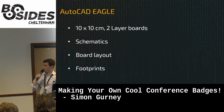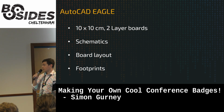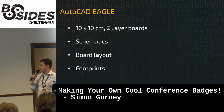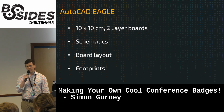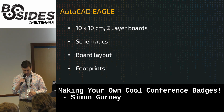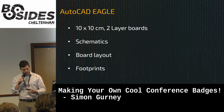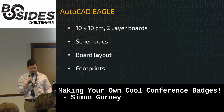So AutoCAD Eagle is absolutely free, up to 10 by 10 centimeters, 2-layer boards. So that Baby Yoda we couldn't do on it because it's a 4-layer board. And if you want to do something big like this DeLorean, you need to pay for the license. But 10 by 10 easily covers this on the free version. And then in there, the 3 things you're going to look at today is schematics. So how you do an electrical diagram inside Eagle. Then how you're going to lay the board out. So that's the actual laying out all these panels and the solder mask and all that stuff. What does that look like? And then footprints. So when you start putting components on, where do you get the bits for your component so that you can put it on the board properly and join up all the dots?